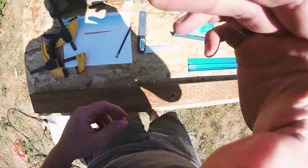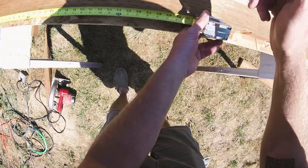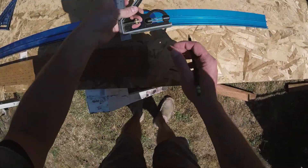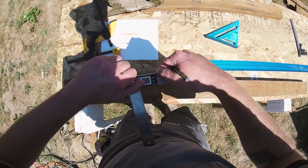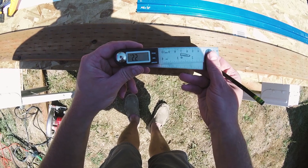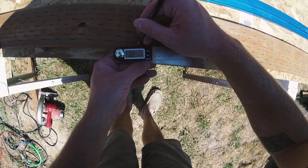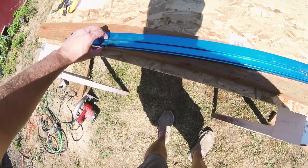Before this point I was wondering how I was going to cut the ground angle on the joists — I think it was a case of overthinking it. It occurred to me that I could just freehand the cut with my circular saw, and once I had the line on there as a guide, it worked really well. Being absolutely precise isn't necessary here; as long as the cut is generally the angle it needs to be, you're okay. I'm using the protractor here just to mark the ground angle on the board — it's just a sanity check to make sure the angle is correct by connecting the two lines with a straight edge.